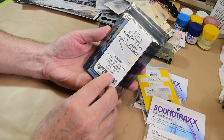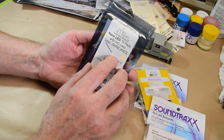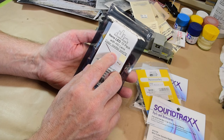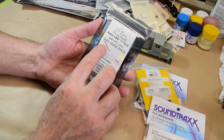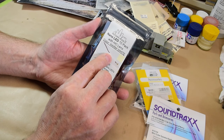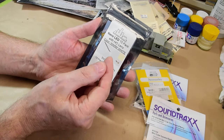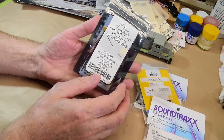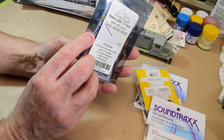For lights I'll be using these by Motown Models. I order them in 10-packs from motownmodels.com — he ships right away. These are warm white, which I like for all lights on my locomotives; they just have a look that seems right. You can get the regular LEDs or the ones with an HO lens already mounted, which I like because I just thread them through the ditch light or bezel receptacle, pull them through, and tag them on the back with a little canopy glue. They have shielded black-and-white wires, very thin, so no guessing when wiring.